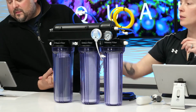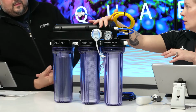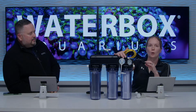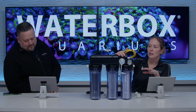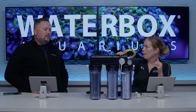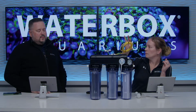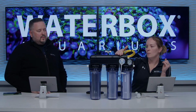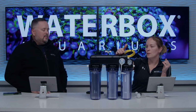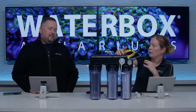And from here, it's going up to the top large canister, and this is where your membrane is housed. The membrane does 90-some odd percent of the work of the RO unit. Say your water's coming in at 350 TDS, it's going to go through the membrane, and the membrane's going to have an output, and this is your wastewater. Then there's the good water that continues on. So this membrane's going to take that 350 TDS down to like 2, especially when the unit first starts running. So it's doing the majority of the actual push out.